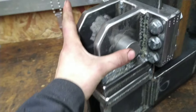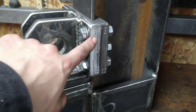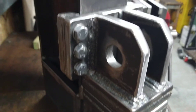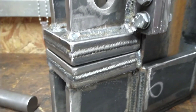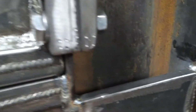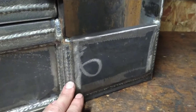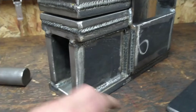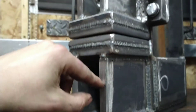You can see the pins moving nice and freely and it's fully welded up. For the bottom I tied these plates in either side, stepping them out a bit to get a nice V for the welding — like a root pass. Then I stepped these in 10mm either side so you can get a nice fillet weld there. With the pressure forcing down it just keeps everything in place.